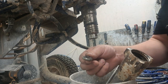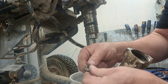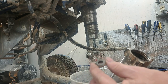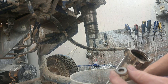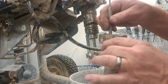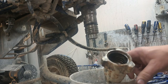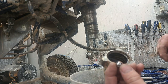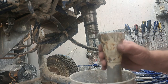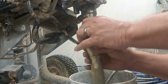The seat is two-sided, so this side was facing up — we're going to flip it over because the other side should be okay if this side is in fact damaged. I'll secure it so it doesn't flip while putting it back in, then drop it in the hole. Here's a new ball — see the difference in appearance, nice and shiny. Drop that in, then put the ball guide back in and seat it all the way down.